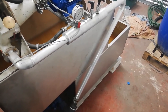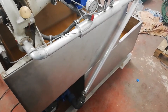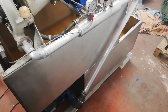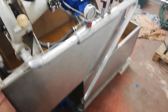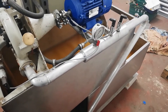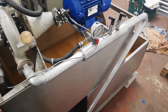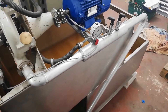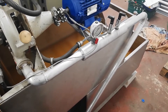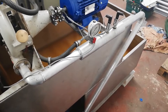We're providing pressurised water for the turbine from the pump, which is the device down underneath the top tank with the pipe that comes up along. We also measure the flow through the turbine using a Venturi device, where we have two pressure sensors measuring the pressure at both the large diameter section and the small diameter section, and this allows you to calculate the flow.